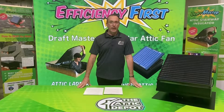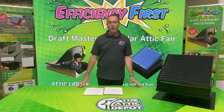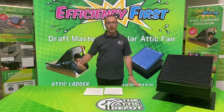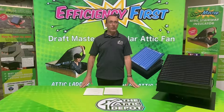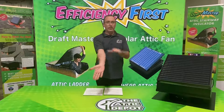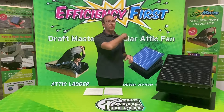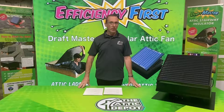Regarding placement on which side of the house — it's usually preferable to put it on the back. A lot of homeowners associations don't allow the fan to be placed on the front or where it's visible from the street. If you do have to place it on the back of the house and it's facing north, you can mount it and tip the panel all the way up so it faces south, and you'll still get the full effect of the solar panel.